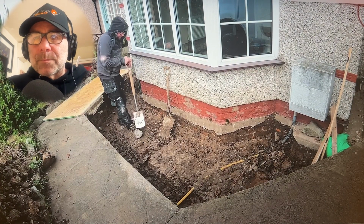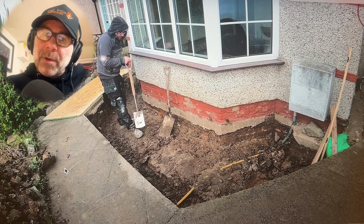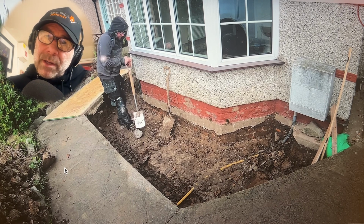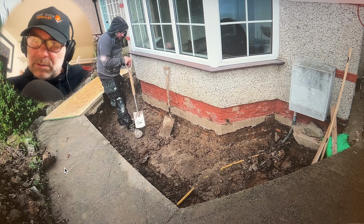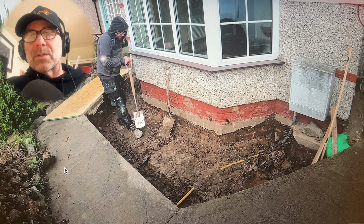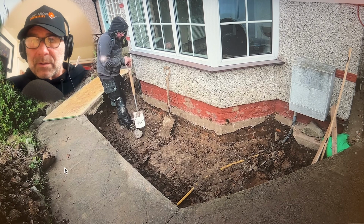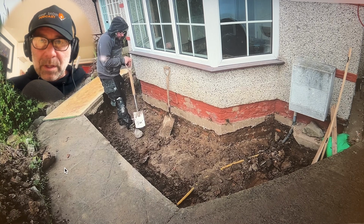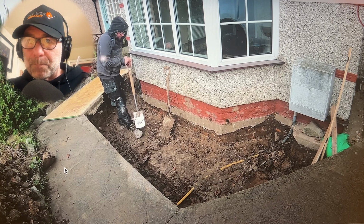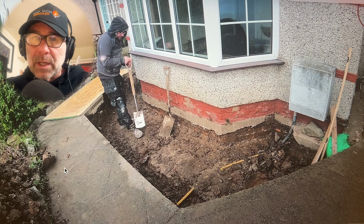Let's have a look here. So floor level's just below where that air brick is. No, floor level might be higher actually. So yeah, floor level could be higher. I'm wondering whether that air brick goes straight out. I'd say, yeah, so we've got render stops. That's probably floor level, and that vent is a subfloor vent. So I'd probably say it needs more subfloor ventilation. It probably wants one either side, one under the gas box, and then one round the other side. You'd probably look at putting some mechanical ventilation in there once you've addressed the issues in the subfloor.